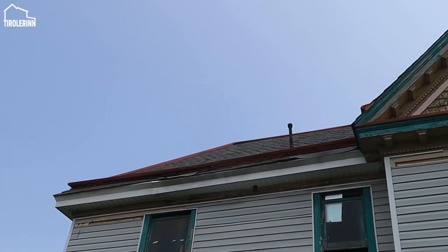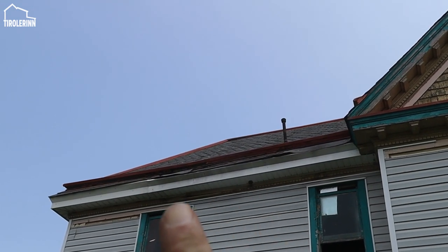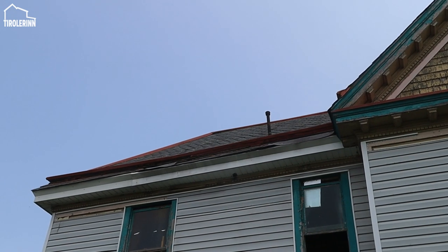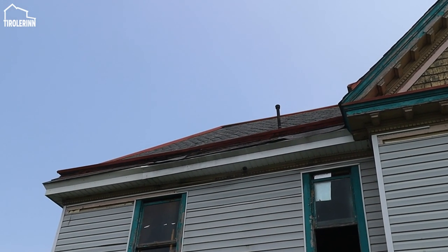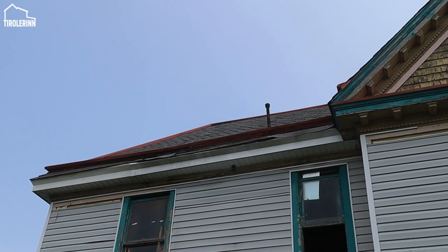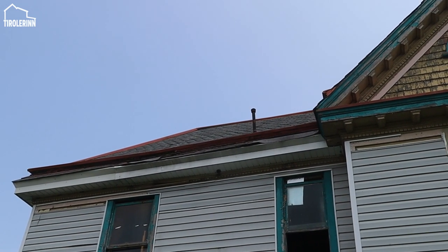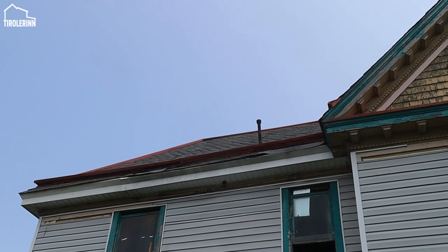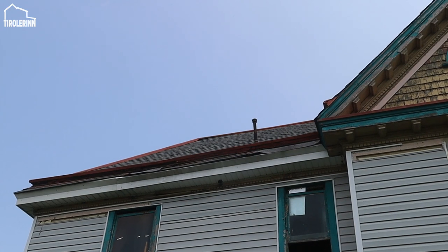This is what I'm fixing. Right up there, the vent here was much worse before, and I'm pushing out that whole roof by like 3-4 inches, so it is a much straighter roof line now already. Obviously we still have to fix a lot, but we've got to support the rest of the roof too. But this is right that spot where we had this issue, and the rafters don't go all the way through and the joists don't go all the way through.